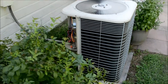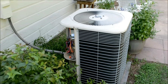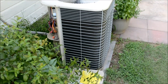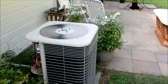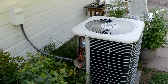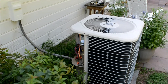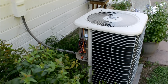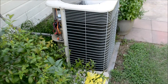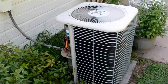I'm going to button this back up and that should be it for this repair. I'm not an expert on air conditioning — I've just worked on these over the years enough to know what to look for. Your situation may be similar but may not be the same problem. I normally start on this control panel side, and every time I've had to repair this unit it's been the capacitor — this is the second one I've put in. First time the fan wasn't blowing; this time the fan was blowing but the compressor wasn't kicking on. A little different symptom, but basically the same problem both times. Alright guys, have a great day.